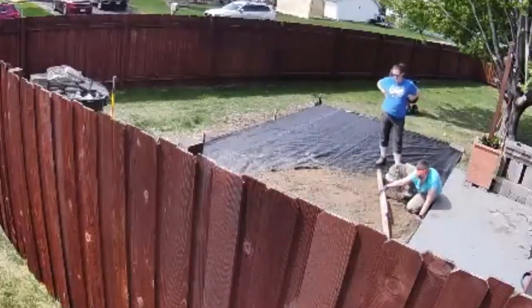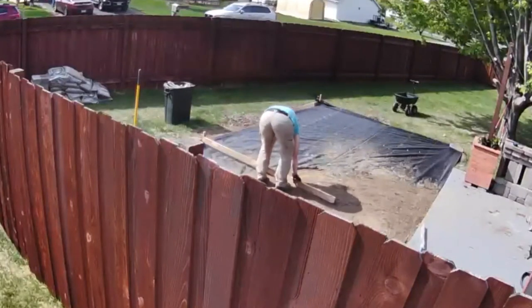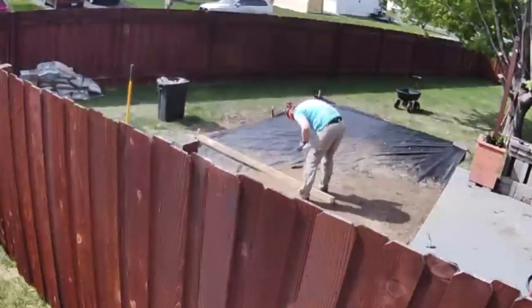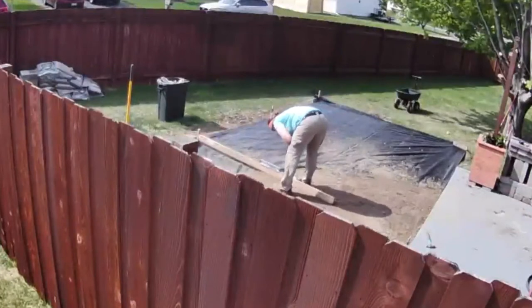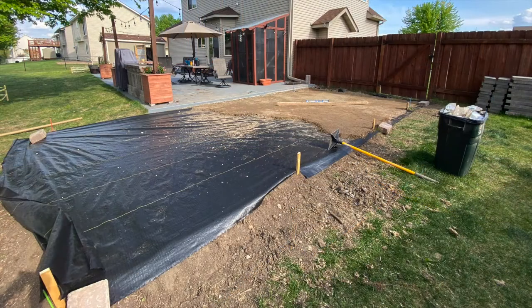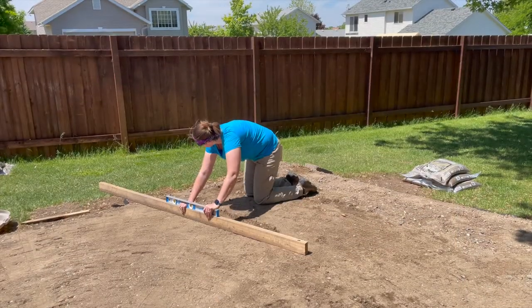I made sure I had sand pressed against the 2x4 to raise it up or scraped it if too high. After doing a small area we would pack it in and move the 2x4 to a new area. When moving to a new area, make sure you have a good amount of compacted sand for the 2x4 to rest in — if it's loose the 2x4 will dig into it. Set it up roughly level first, then work out your areas, slowly working your way to the end using the 2x4 as you go.